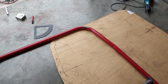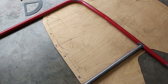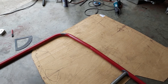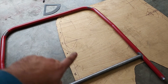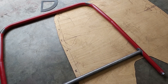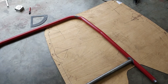We're starting the funny car portion of the cage. The inner side of the funny car cage mirrors the outer portion of the main hoop, so we're using our main hoop template to help lay this bar out. There are two more bars that come down through here, and we're going to get all this welded up and then proceed to the next part.